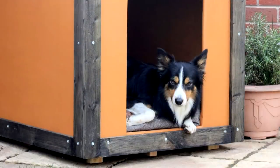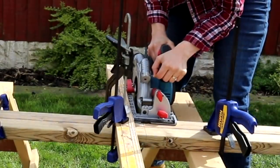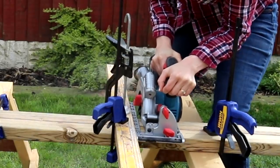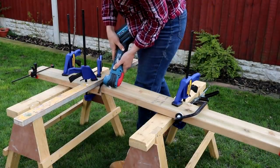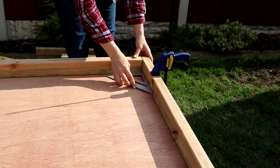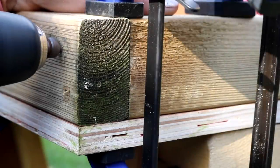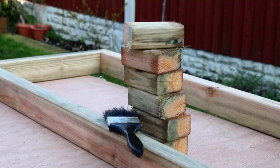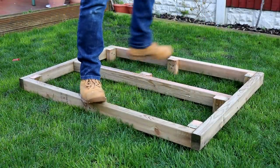Although I didn't make an internal frame, I did make a base frame because I wanted to be able to prop it up off the ground. I clamped my structural pieces of timber together, clamped them to the saw horses, and cross-cut with the circular saw. There will be a full comprehensive shopping list below with all the timber and materials used — this is pre-treated timber because I wanted my efforts to last. I placed an offcut of ply on my saw horses for a flat level surface so the base frame could rest evenly while I pre-drilled, countersunk, and screwed it together. I fixed another long noggin in the centre and cut nine pieces as feet, clamped and screwed them, then flipped it upside down and walked along it — I was really happy with this.